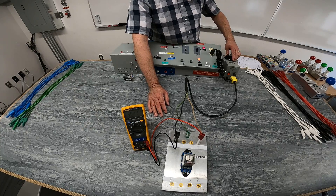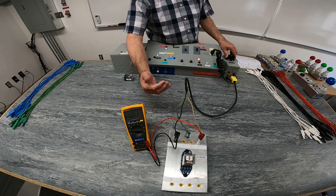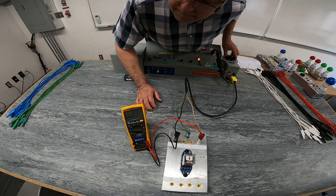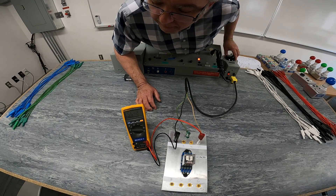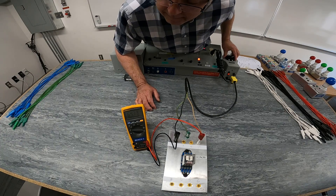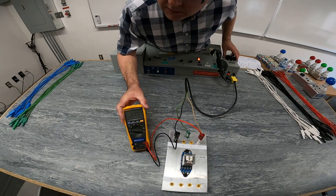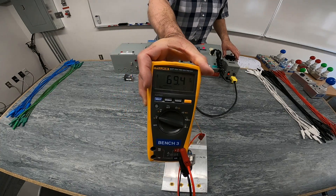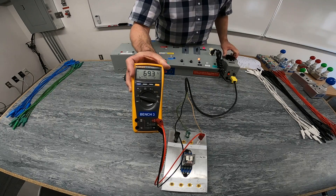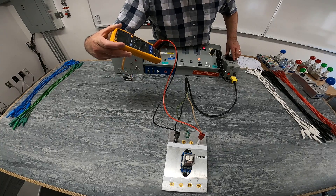You can actually hear the vibration sound. This is the armature actually trying to click into your coil. We're increasing voltage, and roughly about 69.4 volts, our armature now got pulled in by the coil at that voltage. It typically will stay in place until we have our 120 volt supply.